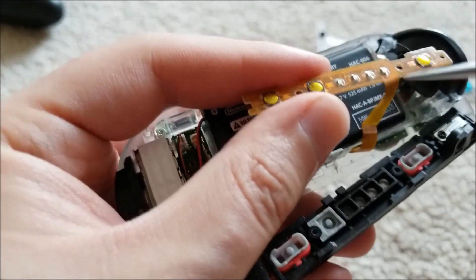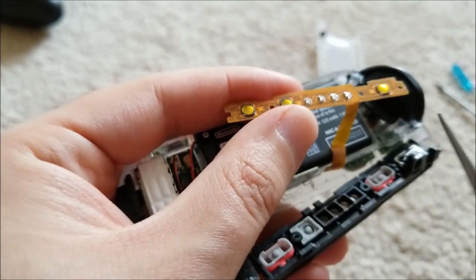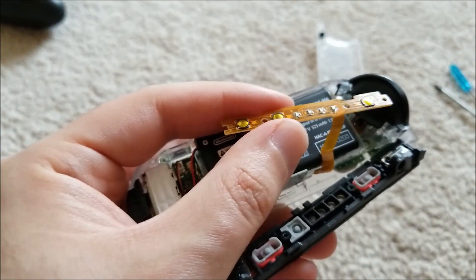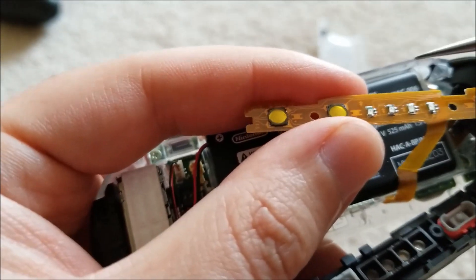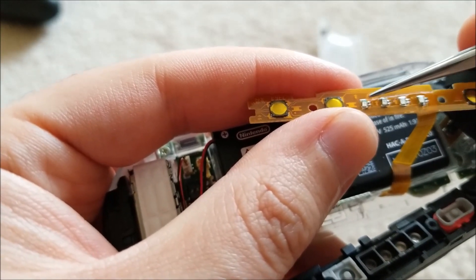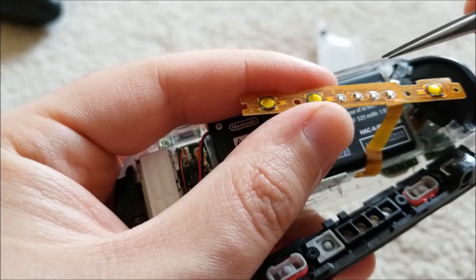Once you remove the LEDs, there are little tiny indicators on the board — you can actually see there are little arrows. They're pointing towards one side, which means the positive side of the LED has to go on that side and the negative is on the other. One thing I usually do is keep a coin battery nearby while soldering and just quickly touch the LED to it to figure out which direction it'll light up. Another thing you can see is one end of the LED is slightly green — that's actually the positive side. And on the bottom of the LED, if you flip it over, you can see a little triangle pointing in that same direction. So those are three different ways you can use to tell which way you need to solder these on.